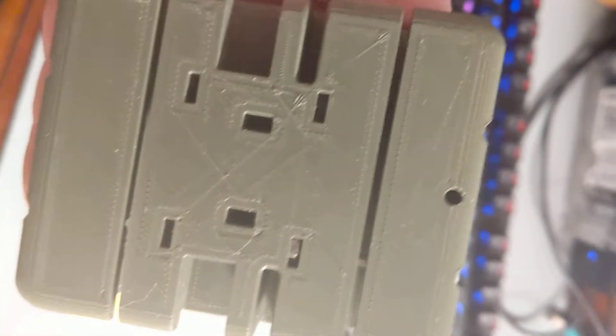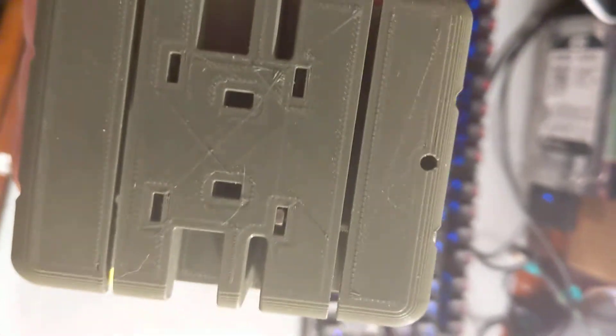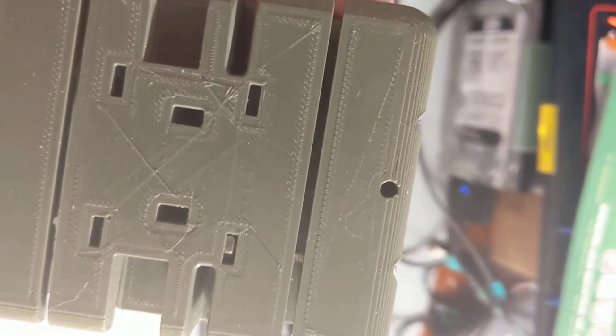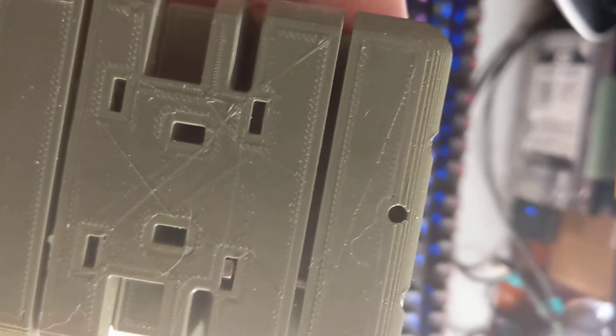Some people wonder — why bother switching over to linear rods or linear rails? Well, it's about the carriage's movement on each axis. If you constrain it enough and keep it from ringing — AKA vibrating, AKA resonating too much — then you can improve your print quality dramatically.